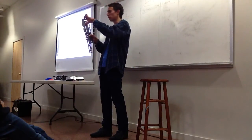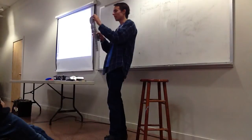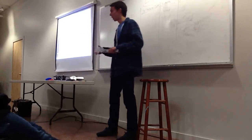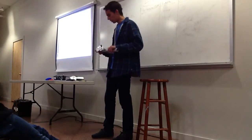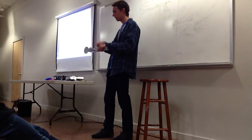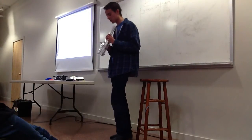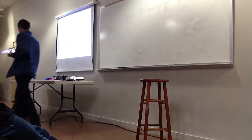Let's say I have this 120 tooth gear turning this 40 tooth gear. With just a very tiny amount of revolutions per minute, this one would turn a lot faster than that one if these two were connected. So how does that apply to that law I just gave, power equals torque multiplied by speed? If you want to get fast, have this gear connected to your motor and this gear connected to your driver. If you want some more torque, if you want your robot to be able to push others around better, but you're okay with sacrificing some speed, you can have this little gear turn the bigger one. That's some advantage that gears have.